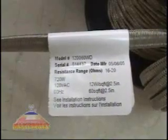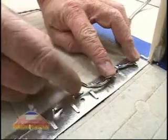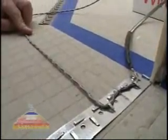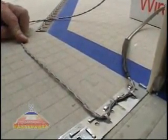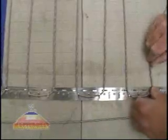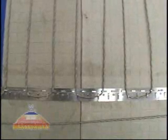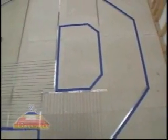Once you've checked the labels, tested the heating elements, and set up the loudmouth, you're ready to secure the wire in place. At the control location, install the wire in a zigzag fashion. This holds the cable in place while you continue your work. You can get 2.5-inch spacing by counting 2.5 tabs on the strap. Don't ever space your wires closer than 2 inches, which causes overheating. Fill in the first section with wire.